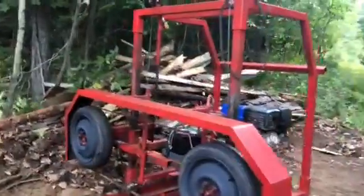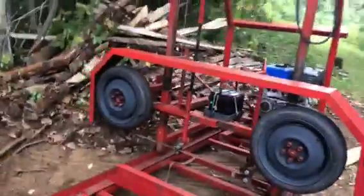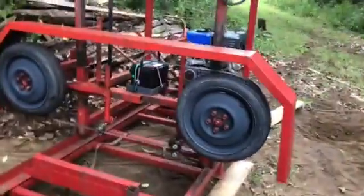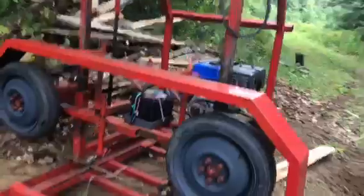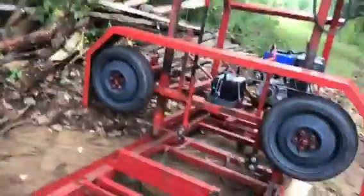We're back at the sawmill after quite a while. Just got her running, trying to get her tuned up. Had to change the oil, drain some water out of the gas — happens when they sit. Throttle was sticking too.